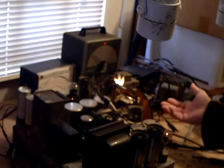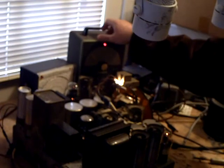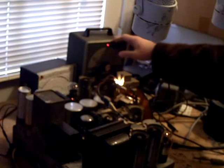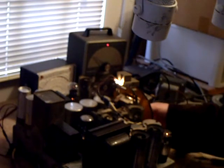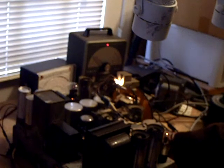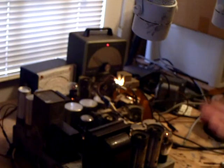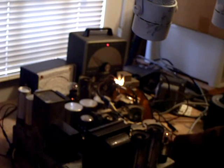To make a long story short, this Heath Kit signal generator I got on eBay for about 40 bucks puts out a lot of harmonics, and I shouldn't have trusted that 3.6 megahertz was correct. After I aligned the whole thing — it's really involved — it seems okay now. That's all I did: just aligned it correctly. I do this for a living and I still made a mistake, so go figure. The misalignment was causing that crazy popping sound. I didn't replace any components or switch anything — it was just the alignment causing that popping sound.